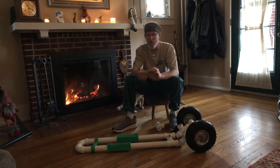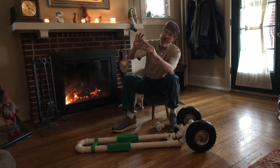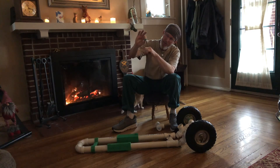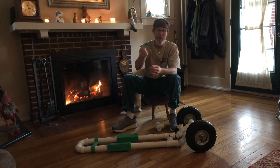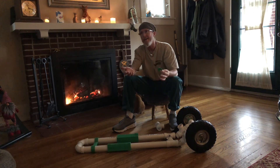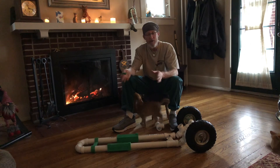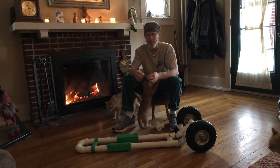Of course, set your infill to 100%. Depending on how big your part is, in this case it's a very narrow thin part, so with four solid layers on the bottom and four at the top there are only a few layers in between — basically it's all solid. Your part may be different, but make sure it's set to 100%. Also, test your part obviously — once you have your first prototype, pop it into something non-permanent and do a leak-down test. We can cover leak-down tests in another video if you want — let me know in the comments. Once your settings are right, you can make as many as you need.